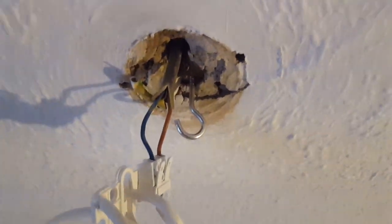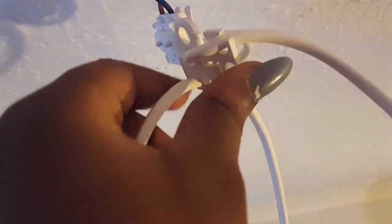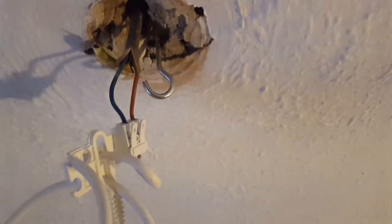Always remember where your screws are in case you need a light fitting which requires a plate. On this — what I would call a wago fitting — it's really good and easy: you just press these down, put the wires in, then feed it through here. This allows you to pull the light up, and eventually it hooks onto the hook on the ceiling.